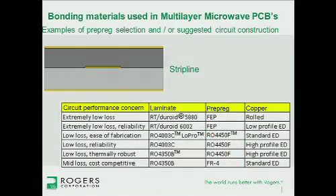Here are six examples of the thought process for juggling different characteristics for stripline. First, if the only concern is loss, you'd use the lowest loss laminate — the 5880 — with the lowest loss bonding film, FEP, and the smoothest copper, which is rolled or rolled annealed copper. That gives you the lowest loss by far. Second, if you want low loss but circuit fabrication is also an issue, you'd probably want a different material — the 4000 series thermoset materials are much more robust to the circuit fabrication process and have very low CTE, so they handle soldering and multiple lamination cycles well.